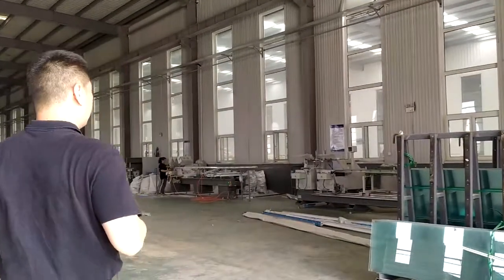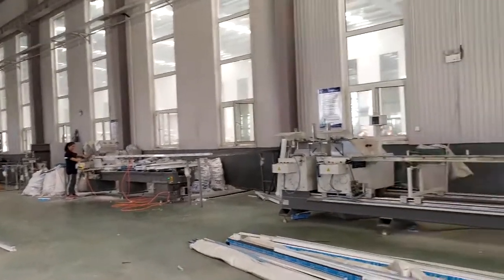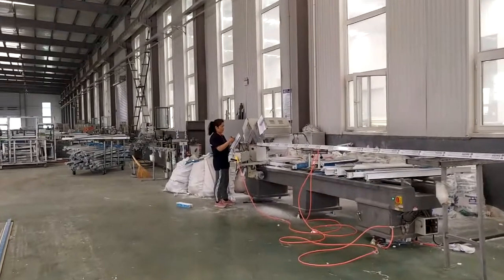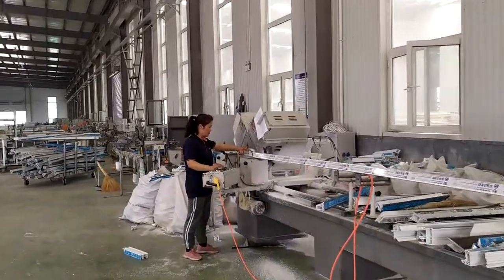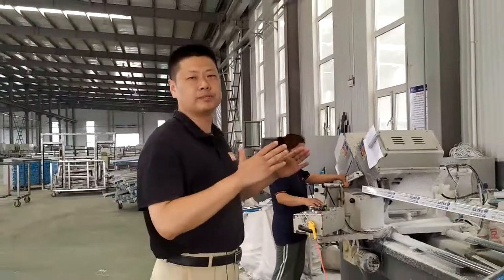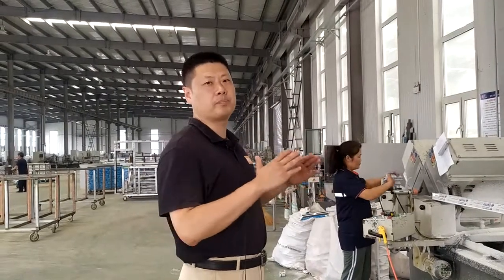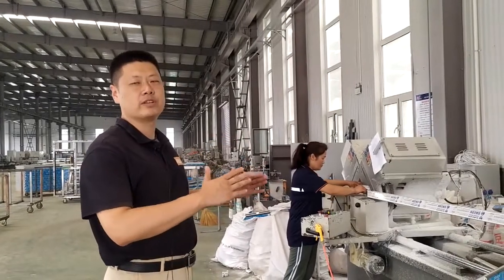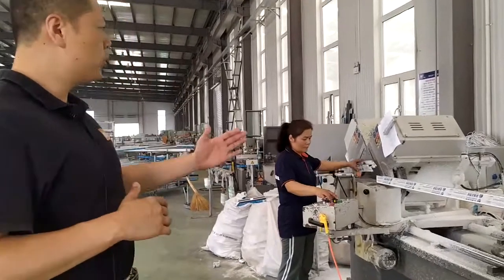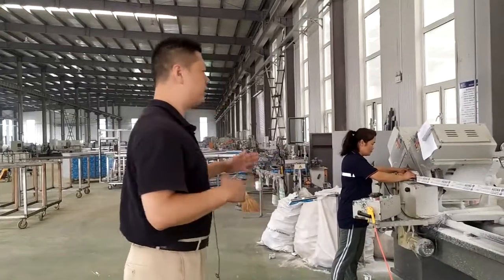Just follow me. As you can see, the process will start from the cutting machine. This is a double head cutting machine. Each time you can cut up to 2 profiles, and it has 2 saw blades. Every time you can cut at 45 degrees angle. This is the first process for all of your frame and the sash. The exact size you can set up by the movable head.